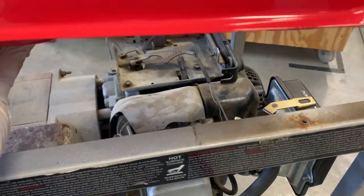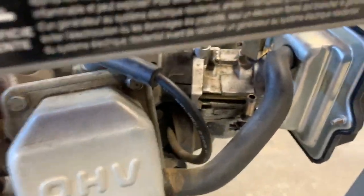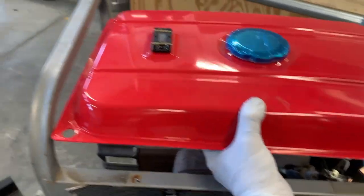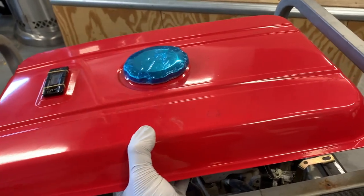There's the opening for the petcock on that side, and that's where the fuel comes into the carburetor right there, so they're on the same side. The last thing is we want to make sure the tank sits down below the bar on each side in case something hits it — we don't want it striking the gas tank.